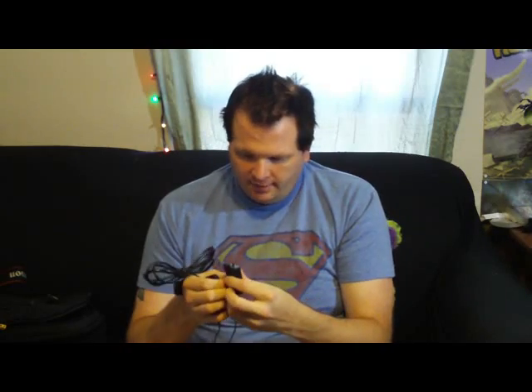You need to get your camera. The next thing you need to get is an AC adapter — I just bought a $15 one off Amazon.com. The AC adapter comes with a cord, a converter, and this neat little thing. As you can see, it looks exactly like one of the batteries except for the fact that the AC cord plugs into the side and then goes out the side of the camera. What we're going to do is take this AC adapter, cut the lead wire, and splice in a connector. I personally use high-end RC car connectors because these are made to hold and take a lot of amperage very fast, much more than the camera will do, and they're designed to hold very strongly. The ones we're using here are labeled the XT60.